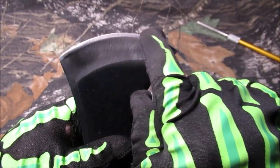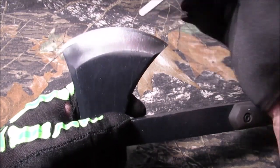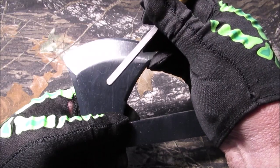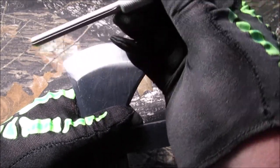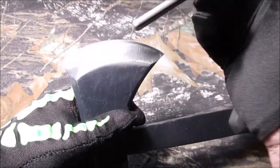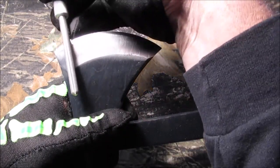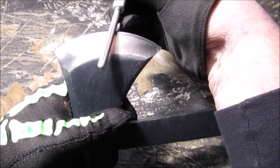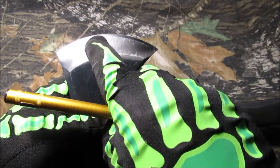We didn't like how rough it looked so we spent a lot of time - probably an hour into this. See the flat side? My diamond hone - I can't tell you the brand, it's like my Smith sharpening system. They make them all kinds of brands. We went on the flat and smoothed all this. See where it changes the bevel? Then we went out here and put what I call a micro edge - a sharp edge way out here, real steep.